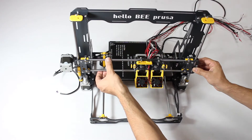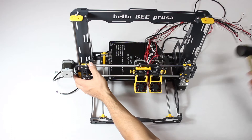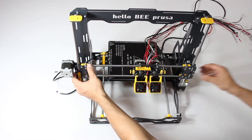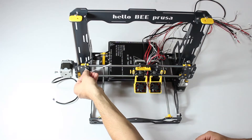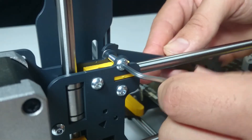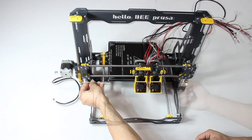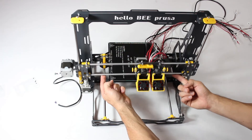Time to finish up the X axis. Slide the whole axis up and down and tap gently with a soft hammer if it feels stuck. Once it's sliding freely, tighten those screws, left finger tight, at the end of the assembly of the X axis. When tightened, check to see if the X axis components slide up and down freely.